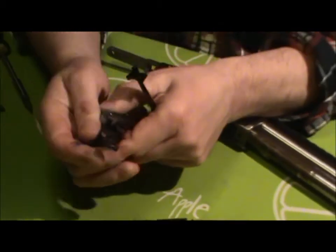I will try to disassemble the gun and show you what I have done so far. I talked about the famous lock-up. You are probably bored about me talking about this thing. But it caught my mind — I couldn't do anything about it. It could be here, or it could be the carrier binding inside. So I did a little bit of filing here, and it didn't improve nothing. The problem was here — on this spring-loaded hook. It binds right here.